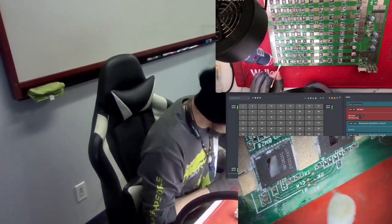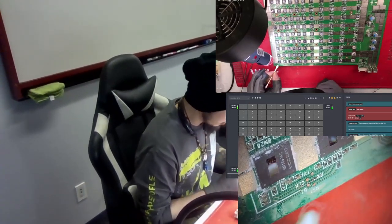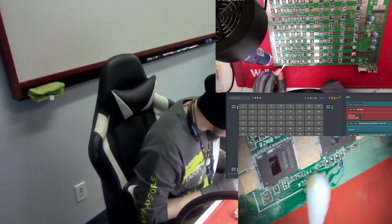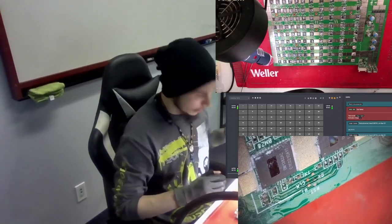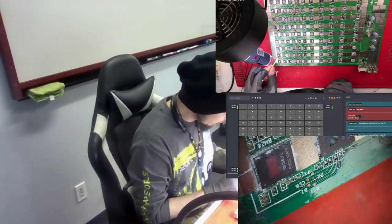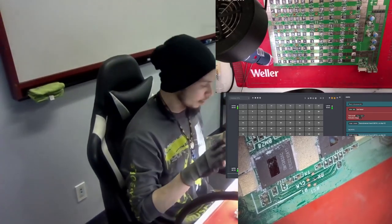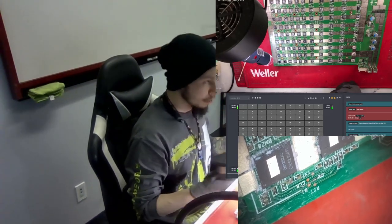We're not sure why this issue is occurring with all those S19 models. I think it's linked to the plastic layer they put between the heatsink and the chips and the hashboard. Everything it goes through might create humidity pockets and then corrosion occurs. Sometimes it's inside, sometimes it's just on the other side of the chip, but it's always in those corners — on S19, S19 Pro, J, J Pro, A Pro, even L7, and all other models that resemble this. Those two corners always have a weakness.